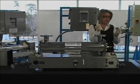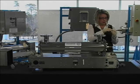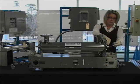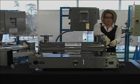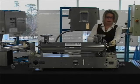You're now ready to install your O-ring into your compression nut, all the way to the bottom beyond the threads. You can now push the quartz sleeve onto the compression nut. This may take some twisting and pushing. Deionized water may be used as a lubricant.